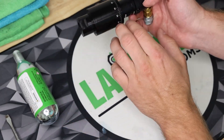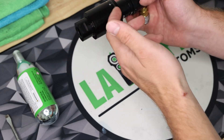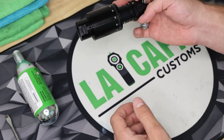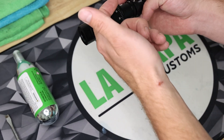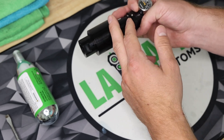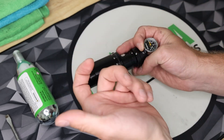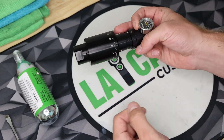What this does is prevent liquid CO2 from getting into this middle part — it can't come out the top because with gravity, the liquid will go to the bottom and the gas will go to the top. So these numbers are to help you indicate where the top of your unit is when it's completely screwed in, and then you can adjust the inside baffle to face that direction so that only gas can come out, because it's coming out of the top of the unit.